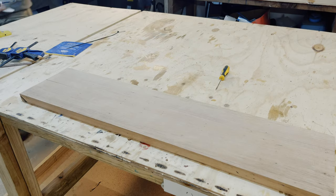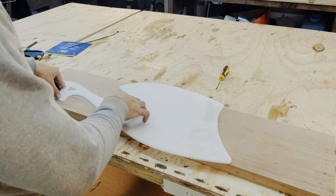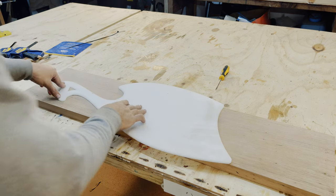This is really hard wood. What we do next is we trace out our handle, rough cut it with the jigsaw, then flush trim it with our brand new router bit.